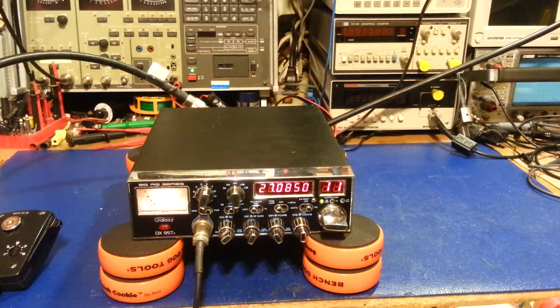I did a transceiver alignment, and the last thing I always do is check it on the spectrum analyzer. I narrow in on 54 megahertz to check for excessive output there. It's actually not adjustable on this radio — they did away with the tunable coils on the 54 megahertz trap circuit, which is probably good, because people would adjust those for peak power, not knowing they were just increasing output in the 54 megahertz band. With fixed coils there are no screws to turn.